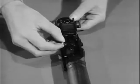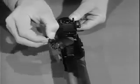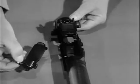Then, to remove the bolt group, grasp it by the roller, and while sliding it forward, lift it upward and outward to the right front with a slight rotating motion.